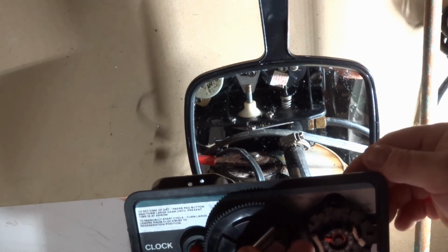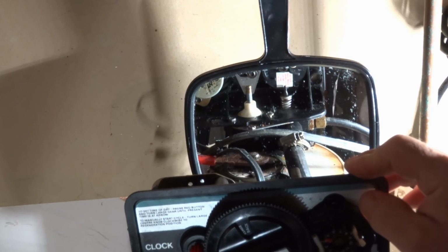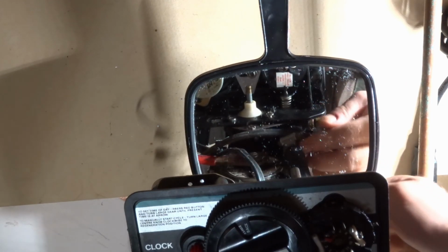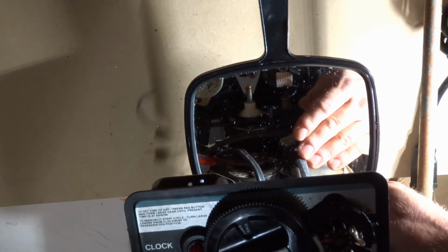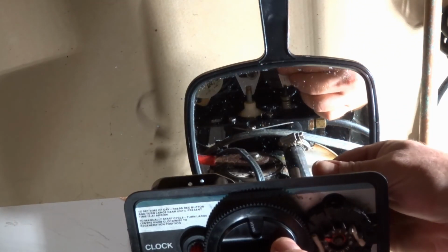So what you can do is you manually go through the settings. The first setting here, it goes into a back rinse, and right away there, you can verify that there's flow going into your drain through the rinsing. This is the pipe that goes to the drain where it backwashes and rinses. Should be some decent water flow out of there. Could be plugged.